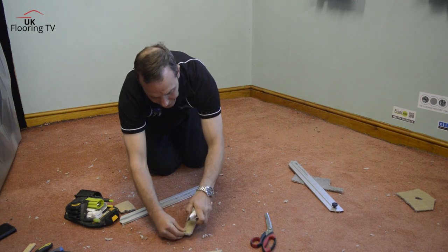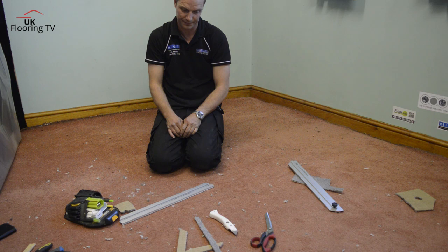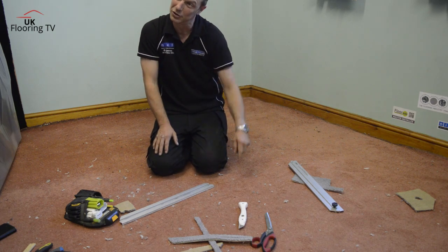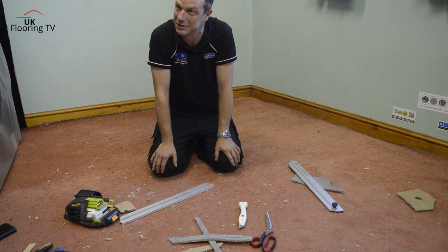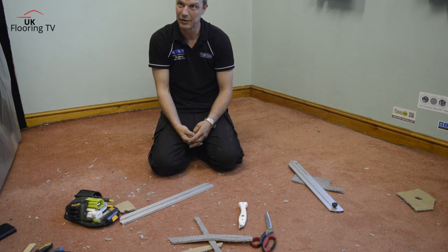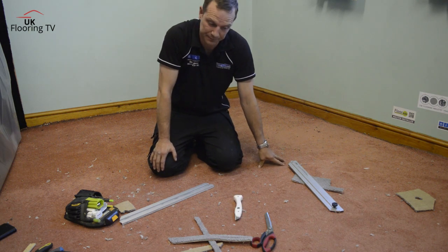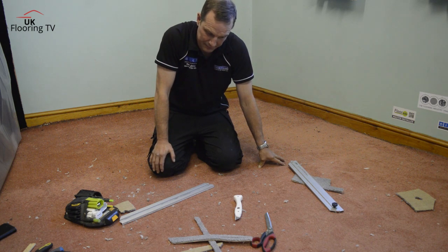So again, you just cut half through and then you can easily follow the cut. The rule is: sharp blade and cut away from you. If you know you're going to cut yourself in a tricky spot, watch out for it. The back corner of a winder, when you have to lift it up to do the last two centimetres, is a prime place to cut your thumb. Safety in the workplace is a big thing, especially when using young lads with Stanley knives.